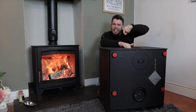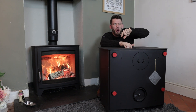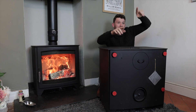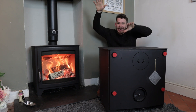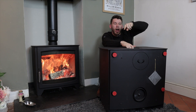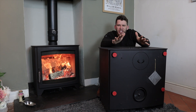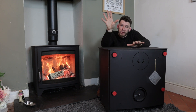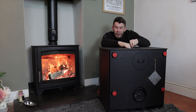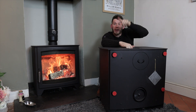Ordinarily this is all run around by gravity or convection — it's not pumped. It's just naturally happening through the balance of pressure and heat moving the water around. It will go down through your cylinder, often through a heat dump radiator, which might be a towel rail. This means every time you get the stove hot, you're getting the water hot and your towel rail hot. Then it runs back down to the stove, gets heated up again, and goes round in this loop.